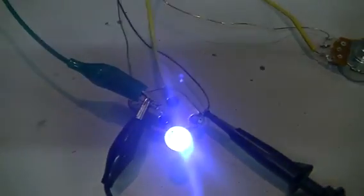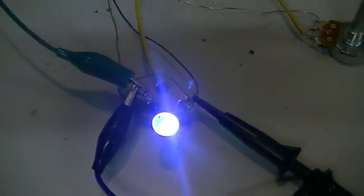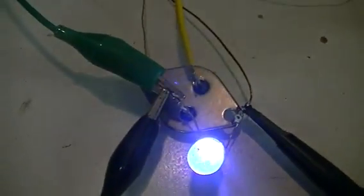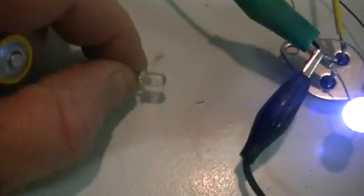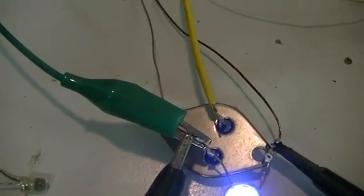Plain Jane solid state SSG circuit, no problem at all — running at 0.25 volts, nice and stable. So that kicks any claim that nothing works as well as the Joule Thief circuit, or the original most commonly used Joule Thief circuit, to drain down these little batteries. This one will work quite fine. We could use a smaller transistor and more turns and get that even more efficient with a small LED. But we are driving a 10mm LED and we are using a beefy 2N3055 transistor with some nice heavy gauge wire, and this is working quite fine.